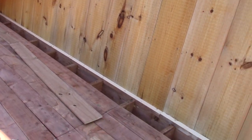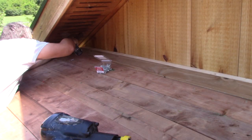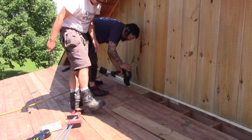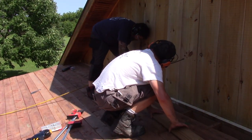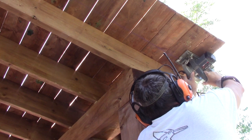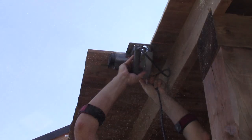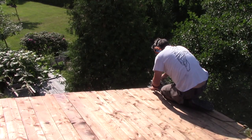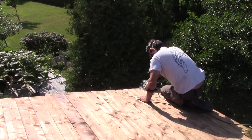When I'm done, we can put them in place, just here. The light colored wood is an angle strip that we nail over the wall plate. We just have to put the last row in place. Now that all the wood is nailed to the roof, it's time to cut it to size. On the other side, I cut it from the top — it's much easier.